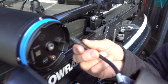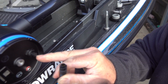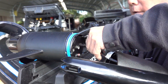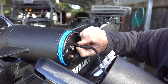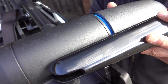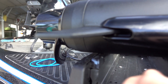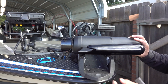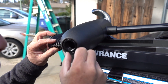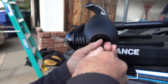Take the cone and first plug it in. Right here there's a little slot — you're going to see that little plastic piece sticking out and the hollowed-out part. Make sure you line it up and put it on so you don't accidentally bend the pin. It's about a quarter of a turn and then you're in. The cone goes right over the top, and this groove fits into the slot where the skeg is — slide it on and push it in. Then take the bolt, stick it in the hole, and tighten it back. You're supposed to apply about 25 pounds of torque, which means snug it good and you'd be fine.